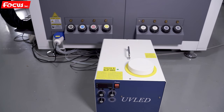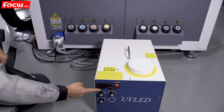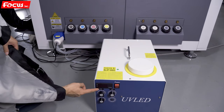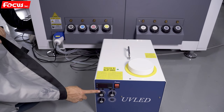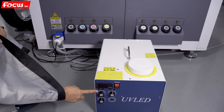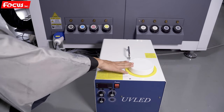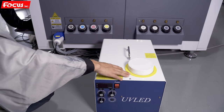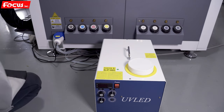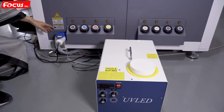When we go to the back side of the machine, we can see this is the UV control box. At the front it has the temperature controller screen and a general power switch for the UV control box, and also three adjustment knobs for each UV lamp. There are totally three lamps: UV1, UV2, and varnish. At the top is the water tank cover — we open it to fill water to get the water cooling effect for the UV lamps.